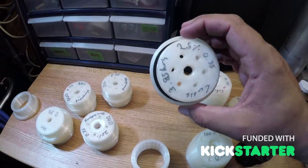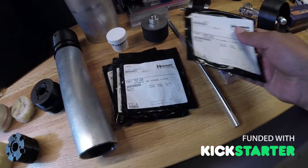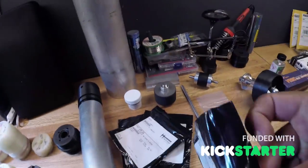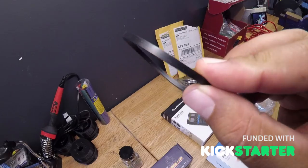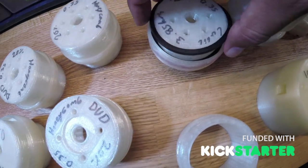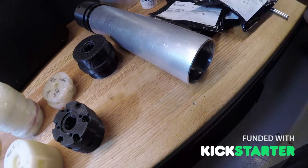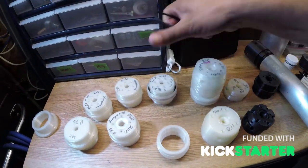Here is closer to a final step before we got to solid printing — you can see the o-ring in there, it's a black square-cut o-ring. Prototyping means you end up spending a fortune since you can't just buy one o-ring, you've got to buy 20 and pay shipping. Here's a square o-ring — you can see the square corners. It slides right down into that groove, and when the aluminum tube threads in, its fine point edge sticks into the rubber and gives you a nice seal.